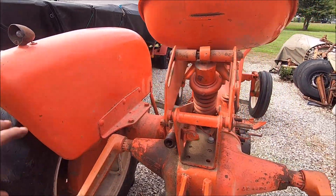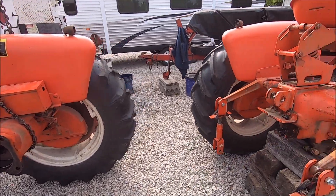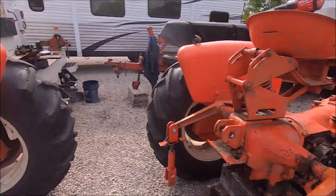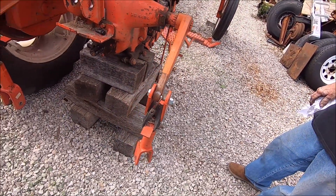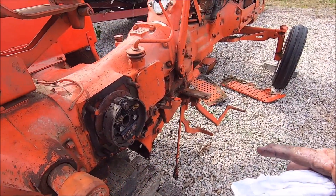We've designed this and hopefully it works. Not everybody's going to have a crane, but I know a lot of you farmers and tractor enthusiasts are pretty smart and good at coming up with workarounds. You should probably take the tire off, but when you've got a crane like mine, why take it off? The auto crane is a godsend - if you ever watch our videos you'll see we use this thing extensively. The tractor is actually blocked up with railroad ties - good and safe. First thing I did was drain the oil out of the gear case.